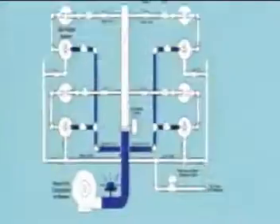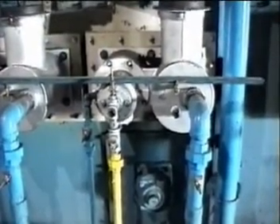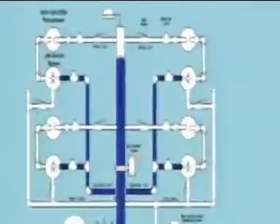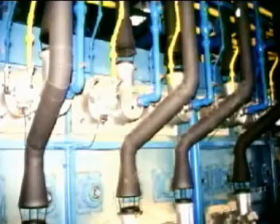On a per-zone basis, the gas tube zone is controlled by a zone regulator, regulated to establish some pressure — typically a half to three quarters of a pound. That pressure is sent straight to each burner, and the flow at each burner is determined by a custom-drilled orifice sized at time of order. When the burner is operated, via a solenoid we simply turn that gas on and off. Each burner in the zone has its own limiting air valve for final set, with just one setting at high fire. Customers tell me they spend between five and ten minutes per burner checking or adjusting them, so on a thirty-burner furnace you can check every burner in two to three hours.